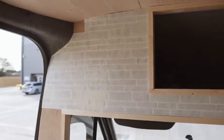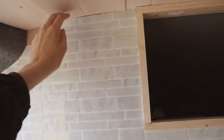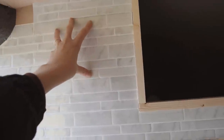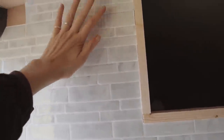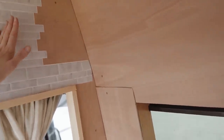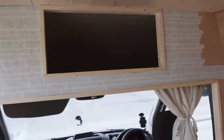Today I managed to get much further ahead in the tiling than I did last week. I pretty much covered the top part of the bulkhead - I'm really, really pleased with how it's looking. This is what they look like - so, so pleased with them. Up here it's just stuck on with masking tape, which is actually a really good way to make sure all the cuts are right and the patterns are lining up before committing to sticking them down. That's just up there for now - I've got this top bit to finish, then all along here. We're having a cupboard starting from around here, so I'm not going to waste tiles on bits we're not going to see.